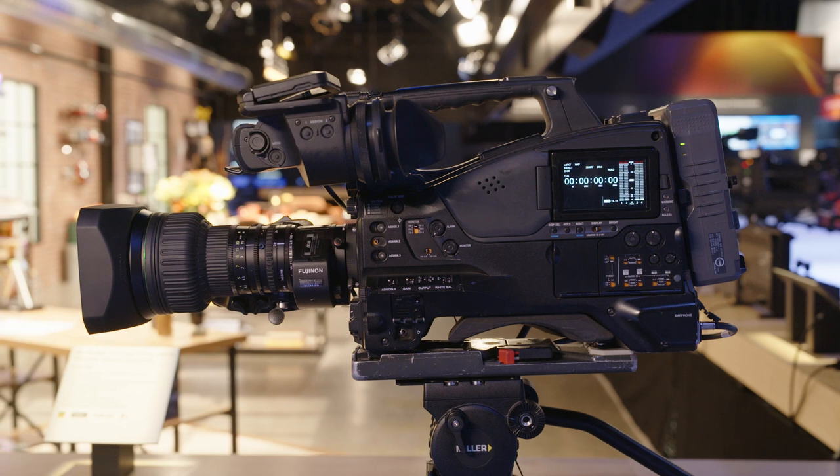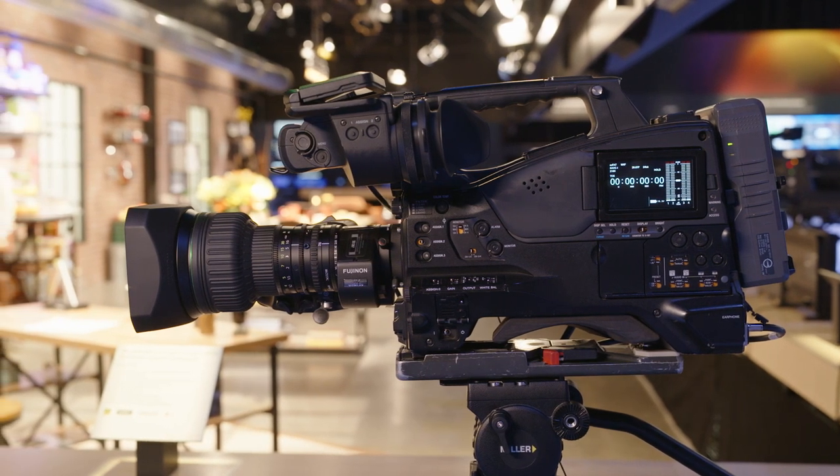To my left here is our flagship shoulder camera PXW Z750. This has been in the market for a few years but is a fantastic camera for 4K recording, dual 4K and HD recording as well. It's got three two-third inch CMOS sensors with global shutter, so it's perfect not only for ENG use but also for production such as in game shows. It does all kinds of formats including our latest XAVC L200 format. It also has built-in Wi-Fi functionality as well as RJ45 network capabilities, and supports low latency streaming — 0.7 seconds from camera to the endpoint of your choice — and also supports file transfers as well.